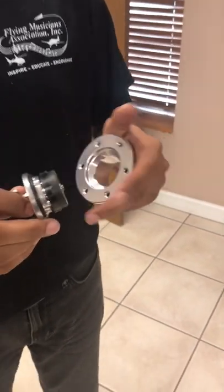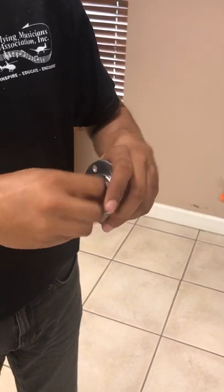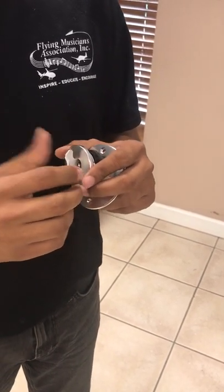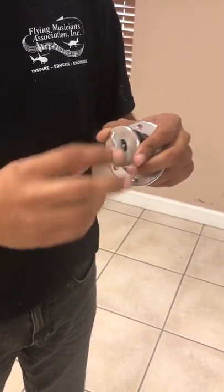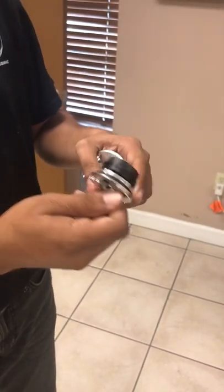You don't force it. If you have done that, you have done something incorrectly. I had a customer call me and tell me that their gas cap came off in flight — they thought it was latched. So that's the first one that's happened kind of like that that I know about. Maybe there's somebody else having a problem, and I just wanted to clarify how these quarter turn gas caps work.